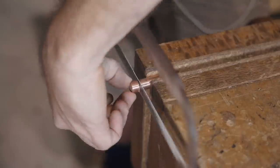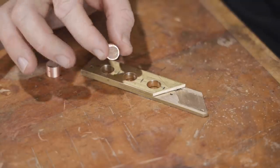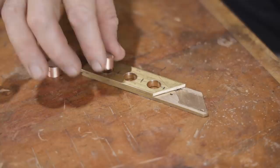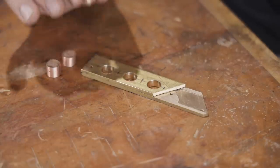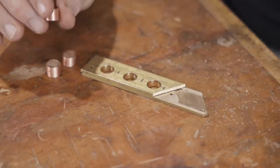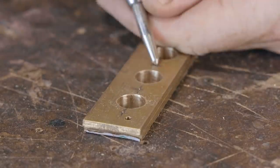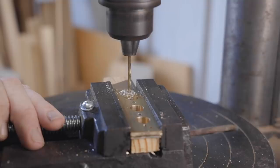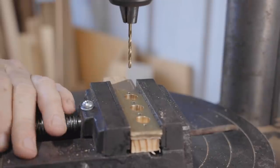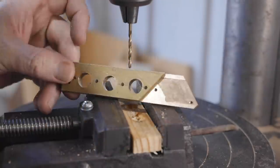The inset pieces are mainly for show but they also add strength to the knife — there's a fair amount of surface area that will get glued into the holes to help keep the whole thing together. I'm a little concerned about the brass heating up and melting the epoxy when I start grinding and polishing, so I've decided to drill more holes and put brass rod in those and pin them to make a physical fixing rather than rely entirely on the glue.